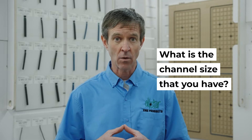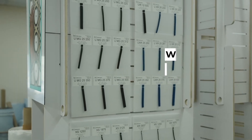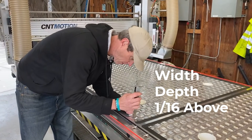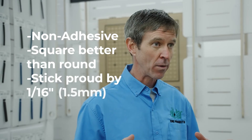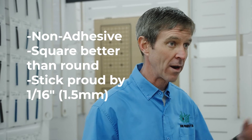There are a lot of different machines out there, which is why we have so many different gasketing products. What we're trying to do is use a caliper to figure out the width of that channel, then take that same caliper to the depth of the channel and add a sixteenth of an inch. That creates a good lip seal all the way around. If you have a few different zones, we're going to want to zone off each one of those. Figure out what the best gasket is for that machine to get an airtight system, and then we'll start holding on to those parts.